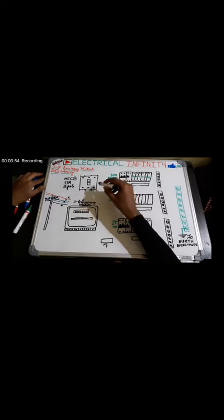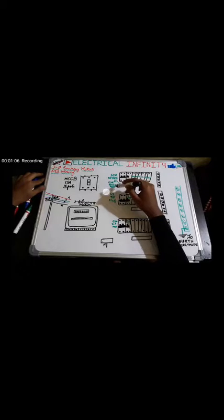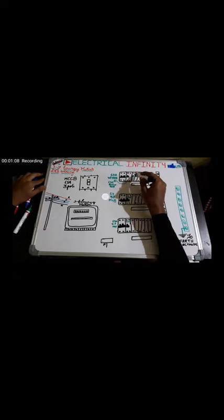So the materials we require are a 3 phase energy meter, a 63 ampere 3-pole MCB, a 63 ampere double pole MCB, and a 63 ampere RCD. This is also called an RCCB. We also require single pole MCBs and an MCB board according to the load.